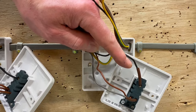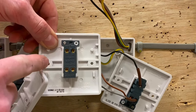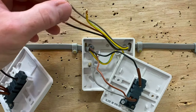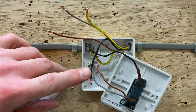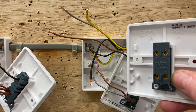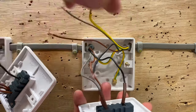We're now going to introduce an intermediate switch — one gang with four terminations in the back: two at the top and two at the bottom, labeled L1, L1 and L2, L2. The cable coming in — we'll use the brown and gray conductors into the intermediate switch. For the newly introduced cable we'll also use the brown and gray, meaning the black conductor will need to go into a wago connector and be left in the back of the box. We'll remove the existing two-way switch now and use it at position three.